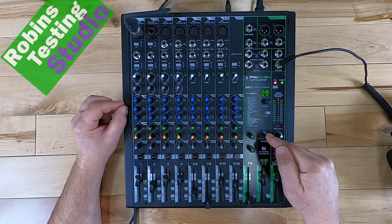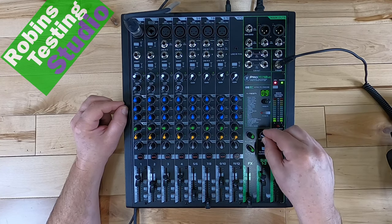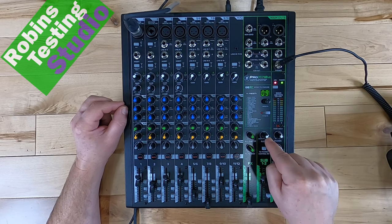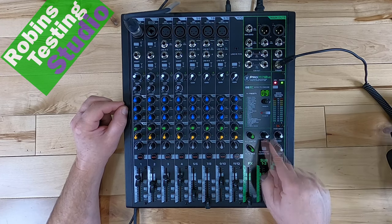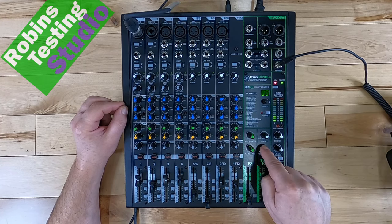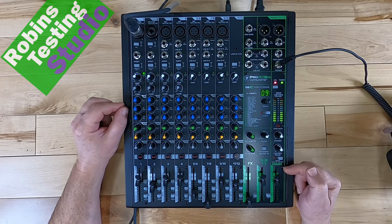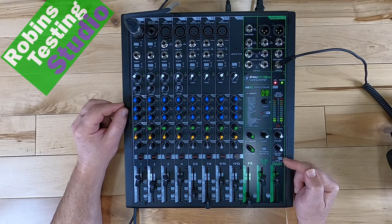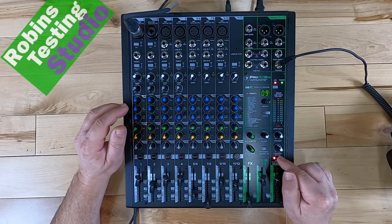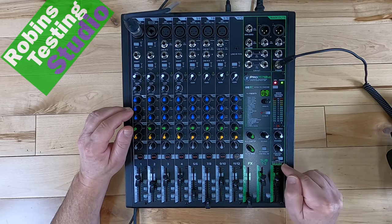The next knob to the right of the aux master is called blend. Blend basically allows you to take the two USB channels coming in on channels 1 and 2 and blend them with the actual mixer, so you can decide how much of the mixer versus how much of your backtrack you want to listen to, just by controlling that left and right. Below that, we have a button that says two headphones and control room, to engage or disengage this function. To the right of that is volume control for the control room, and above that is volume control for the headphones. Just above the main we have a button called break — it mutes all channels. This is a hard mute across the whole board, so if you have to make any rearrangements, you're going on break, or you just don't want anything going out to the broadcast or to the room, you just hit that button.